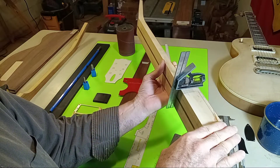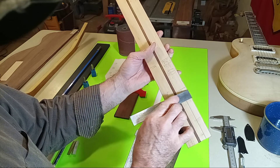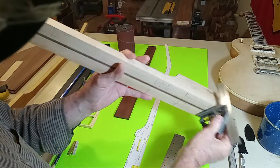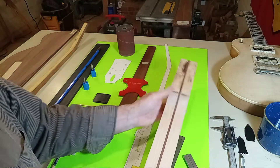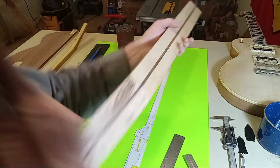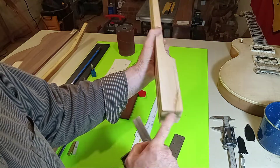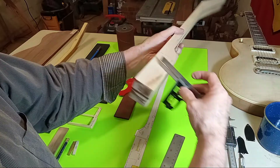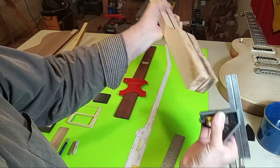The most critical location is right where it joins the body. The area up here is going to get cut off to create the tongue or tenon — close to seven-sixteenths of an inch will be gone. That doesn't mean you can be sloppy down there, because you'll need those S4S areas to do machine work later when cutting the tongue. Nonetheless, it's even true down there — true all the way through.